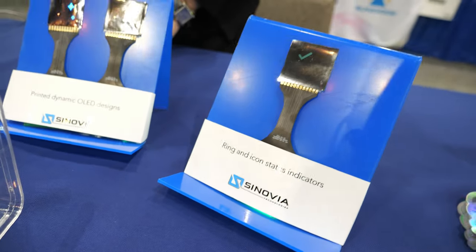And these are reliable? Yes, they are as reliable as other OLEDs. We're using state-of-the-art commercially available light-emitting materials. They have operational lifetimes of 10,000 hours to 50% brightness and shelf life of around five years so far. And with additional testing, we expect to get to a 10-year operational field lifetime. How do you check the five years — you've been on it for five years? No, we use accelerated thermal and humidity chambers to test encapsulation lifetime.